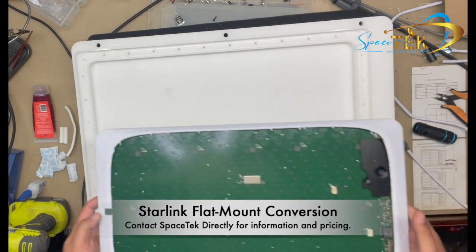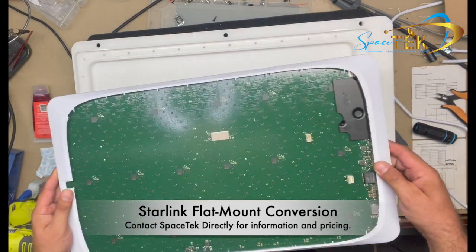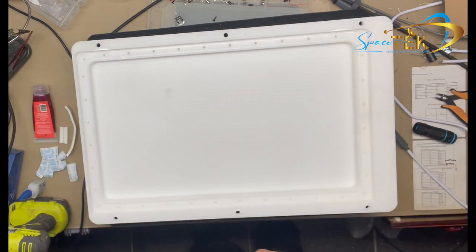We've already had our dish cut in our machine — that's been cut flat, ready to go in this housing. This is the underside of the housing, which has been CNC routed out of a solid piece of plastic. It has a few design features others don't have: it is mounted from underneath, which makes it a lot harder for water ingress, as well as a double o-ring seal — one on the inside, one on the outside. We also put a rubber grease in between these two seals, which helps repel any water that might come in through the screws.